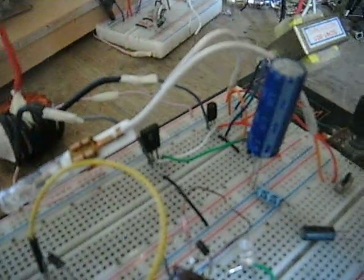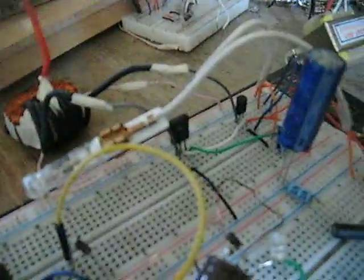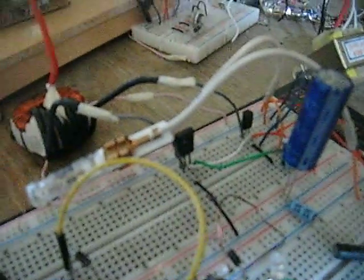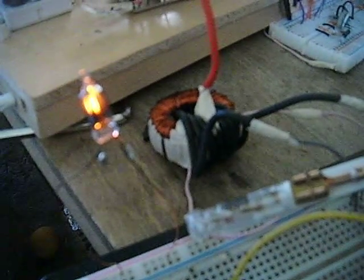Without it, the solar panel was fine. I was even running through a diode so I didn't get any back surge. Anyway, I just thought I'd share that. The toroid has got 60 turns - I think I mentioned it on the last video - 60 turns on the AC out and 7 turns on the end, so it was center tapped.